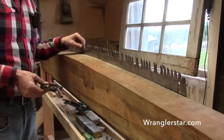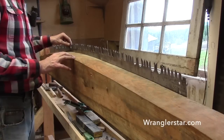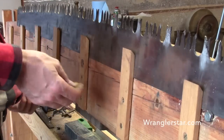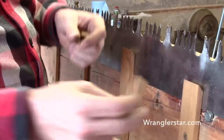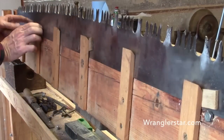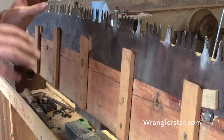This is a bit of an atypical saw - it's a little small, and you can see it's a little wiggly in there. We don't want that. There's a quick and easy fix: because the saw is sitting up so high and not down where the oak strips can bite it well, the solution is to make some small, tiny wedges out of scrap. Poke those in every other strip or so, and that takes all the wiggle out.